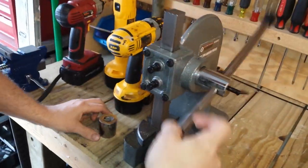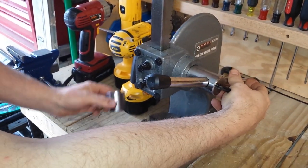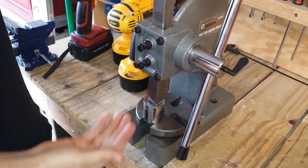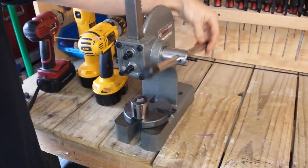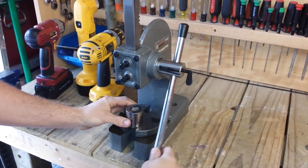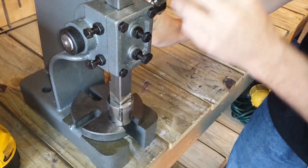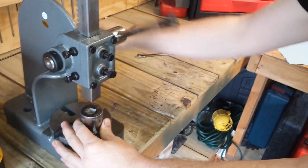Alright, so we're back. Here's the press — I've got it all reassembled. You can see that now when you bring it to the top, it'll do that kind of knocking, clicking sound. But what that does is — say we put our piece in here, roll it around — we don't have an optimal pulling angle right now. But if you bring it back up, let it do a little click, now you're right here where you can get max pressure. Basically it allows you to rotate the handle into a position that'll work the best for you. It's really kind of a nice modification.